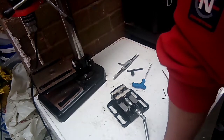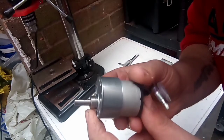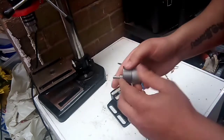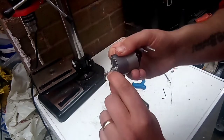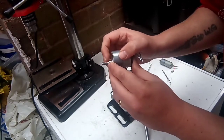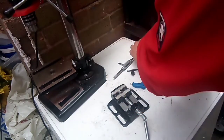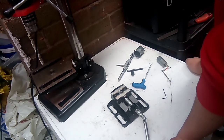Another hint is filing down a bit on the shaft. That would normally be flat all the way, but all I've done is grab the file and file it down where that grub screw would hit. The grub screw then sits inside the filed section. So even if it does work its way loose a little bit, it's still going to be grabbing onto that indented part of the shaft. It's another way of making sure everything doesn't fall off mid-combat. A nice little tip — stop your wheels falling off, nothing worse.